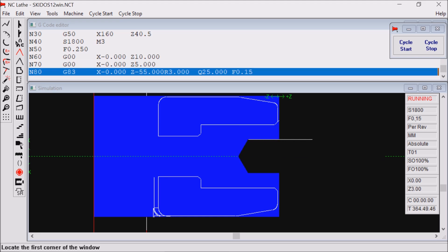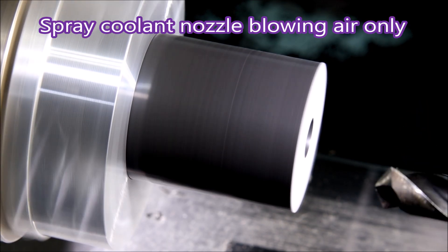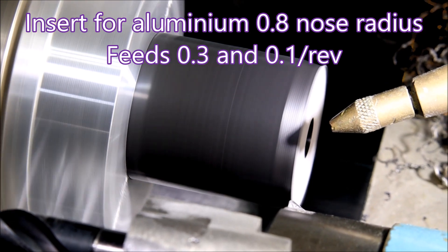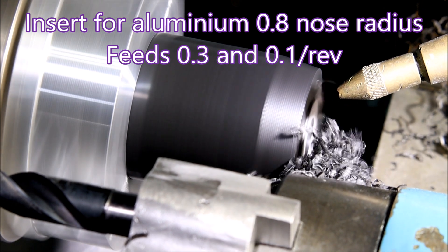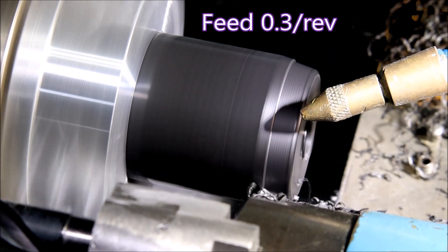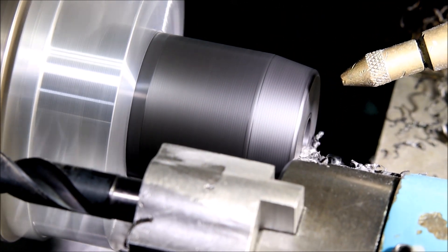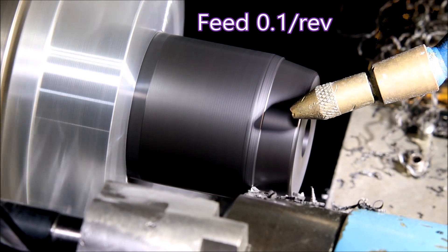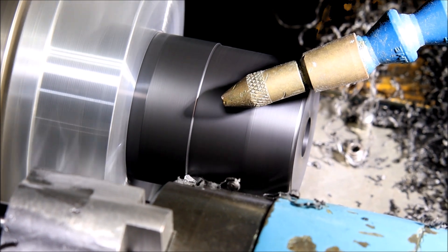Here's the simulation of the drilling. Now we move on to the turning. If you're wondering why the turning is coming next and not the boring as you would expect, it's because I needed the tools opposite each other — the drill and the boring bar — to balance the turret, and it would have been really messy to do the boring then the turning and the parting. This is the most elegant way to set the tools up and have them rotate one after the other in the turret.